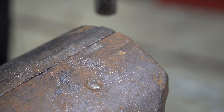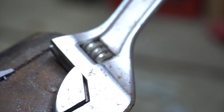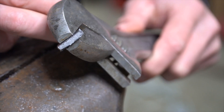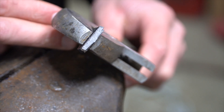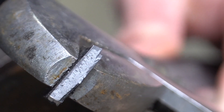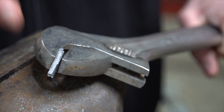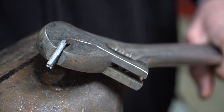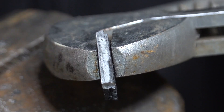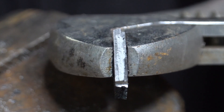What the heck just happened? Let's try that again — that was a good snap. So as close as I can tell, what's happened is this piece hardened somewhat, but it didn't harden up to a point where it would skate a file. The file pretty much still ate right through it, and I don't think it's 1095 whatsoever. I have no idea what kind of steel this is or what they did to it. But hopefully one thing you can see here is just how much more refined the grain structure is within the steel from when we started.